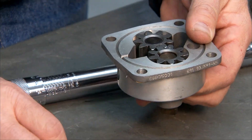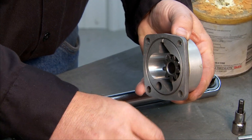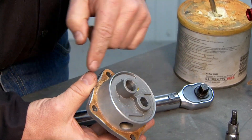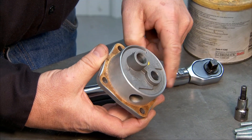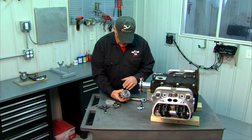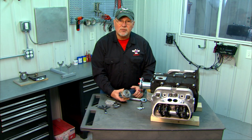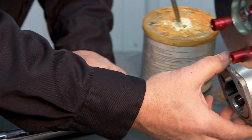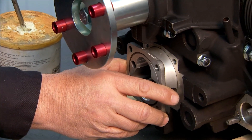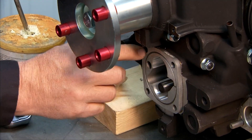Our clearance is good, so we can set the cover aside and get ready to install the pump. We'll take the gears out initially to help us install the body into the engine — just pull them out. Here's the pump body. I've already installed a gasket on the back and pre-treated it with gasket sealer. Whatever your favorite sealer is will be fine — some people use silicone sealer; I've used what they call fuel lube, which is an oil and fuel proof sealer available from sources such as Aircraft Spruce and other aviation outlets. Make sure you put some sealer on there. The pump goes in with the boss for the drive lug up because the camshaft is in the upper part of the opening, so simply slide it into the body and get it aligned with the mounting holes.